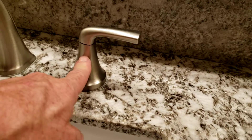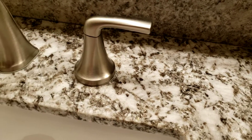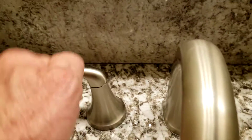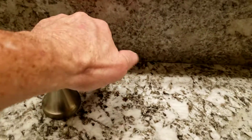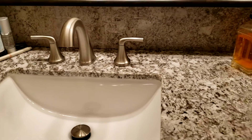That faucet is just a little fussier to work with; this one is one finger on, one finger off — you can see it works great. The sticky one is a cartridge issue — it would need to come back off, get a Pfister cartridge replacement. As long as you don't grab onto these and crank them back and forth, you'll be okay. But over time, over-opening or over-closing will cause them to loosen. Everything here looks good outside of that — the service call is done.